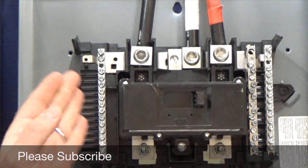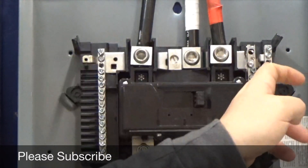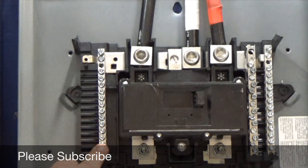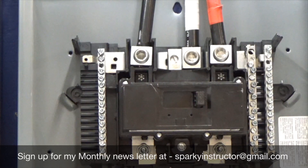This style panel here is a Square D panel and it actually has a bridge underneath — you really can't see it, but if you were to look inside one of these panels you would see they're interconnected to this middle lug. These set screws here — these are what we call neutral and ground bars. In a main breaker panel, one of the things you have to remember is we need to combine the neutral and the ground together at the first means of disconnect.